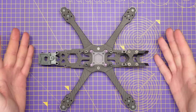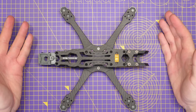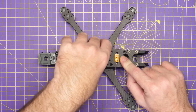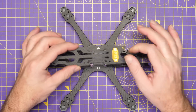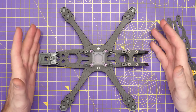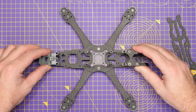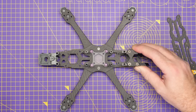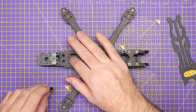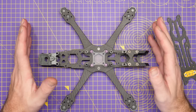I'm at the stage where it's time to put the top of the frame on — you simply place it there, put all of the screws in, and basically it's ready to go. You can see I've fitted the included XT60, which is nicely placed at the front. Your battery is going to go here, which makes a nice easy fitment, and that bolts in place with just two solder points underneath. There are some really nice interesting features on this frame. We have our full CNC front end and the additional included 3D printed parts at the back. There's a hole here which is actually for a heat sink, included with the HD version, and that plugs into the base to help cool the O3 air unit.